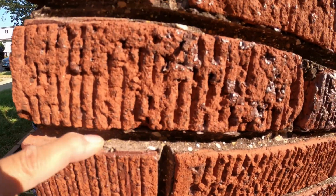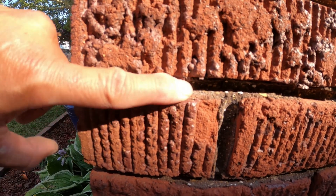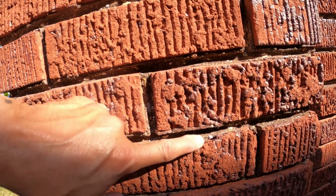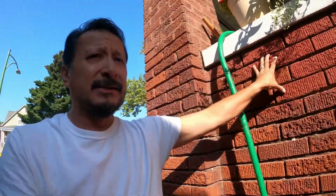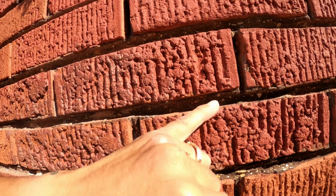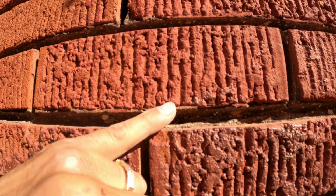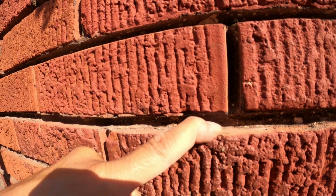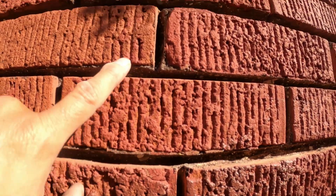In another video — like right here, that's gonna be easy to get down. Do you see? There's brick, there's this other mortar right here, and there's little mortar right here. You want these brick to brick. I grinded out this whole side the best I can. My main goal is to get all this other little stuff out here to get brick to brick, where I got a clean joint to fill in. I gotta get the top off of here so I can get it brick to brick. This is exactly how you want every brick that you're gonna tuck point — because having old mortar residue gives it more of a chance to crack back out.